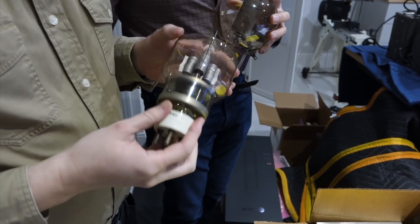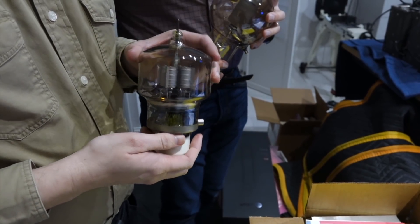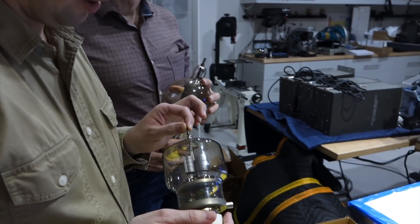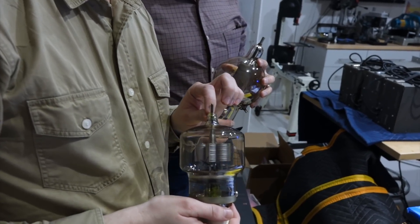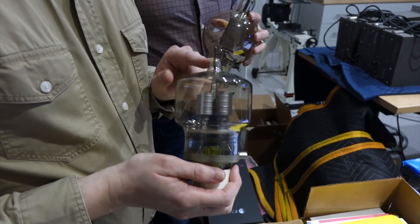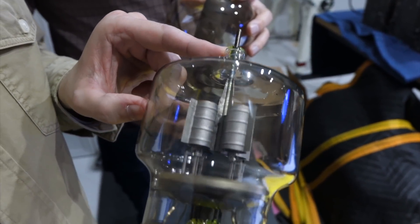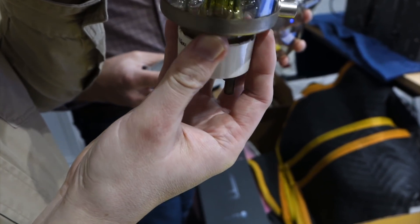Tell me about what's special about the glass. Well, these are almost fossils, so I can probably talk about that. The seal on those — these are high-powered tubes, so they get hot and go through some pretty heavy thermal cycling. The glass-to-metal bond, which is usually what fails on those, is made with uranium glass. I don't really know why it is better, but it helps improve that seal. So it is a bit greenish, and it is radioactive. You can see it's green at the eye and at the base as well, where you have the metal-to-glass bond.